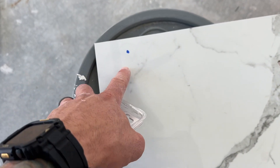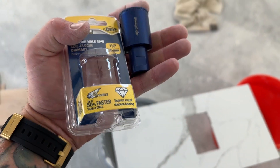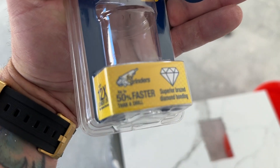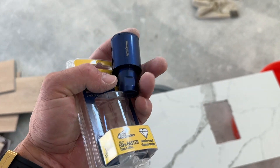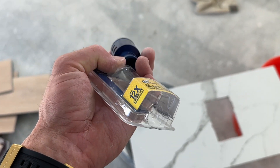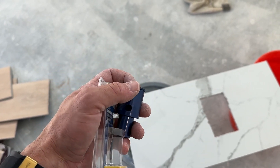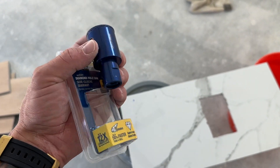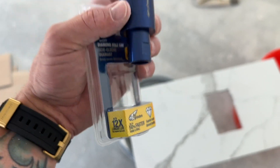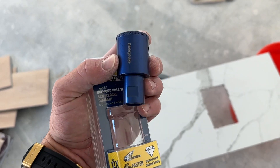This one here is brand new and made for porcelain — this should cut a perfectly clean hole. The other thing to look at is how it connects. This one is made for a grinder, so it will screw on, and I'll show you the technique. They also make this exact same bit for the hand drill with a shaft you can clamp into your hand drill. You can get good RPMs on the hand drill — I have another video showing that through some quartz countertop — but I went with this one because it was a few dollars cheaper for the exact same bit. This is a one and three-eighths.